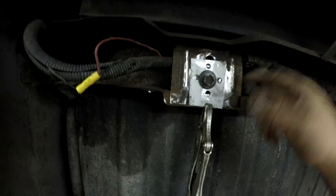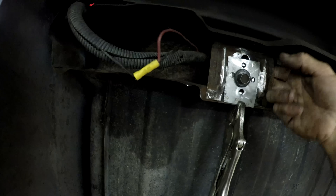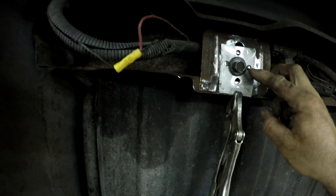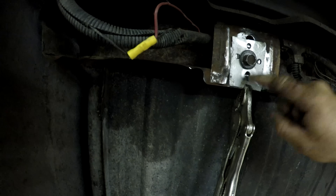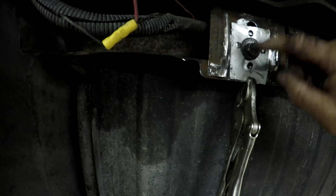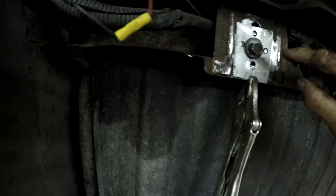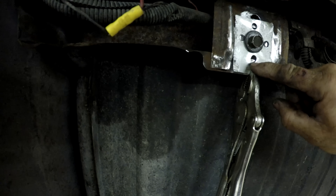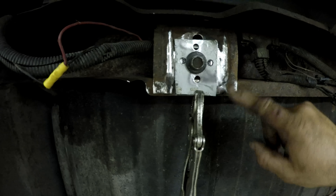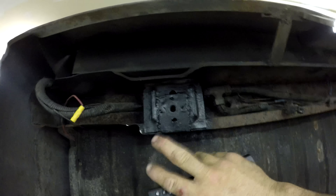I got a nice patch — behind here is like a nut with a brace welded in. That's what these two holes are for, and these two holes are just to weld it to here. I drilled a couple of extra holes but I'll just weld them up too. I got that all welded in. Sprayed it with some undercoating and that's good to go. Used to have a nitrous kit in here with bottle brackets — I just welded those up.